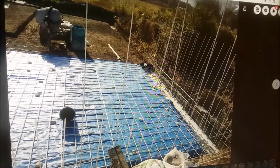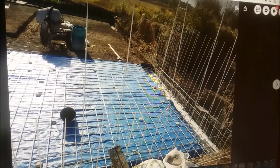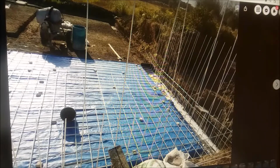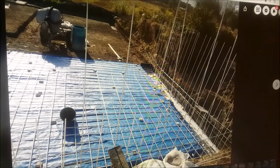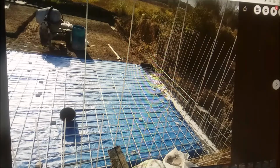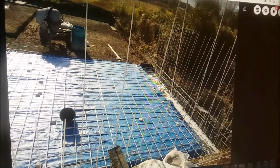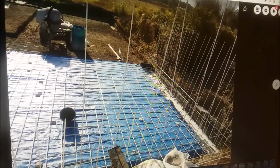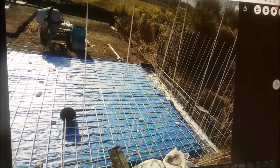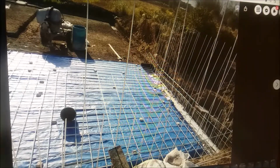They've got the dividing board here on the footer for separating the three pours. A little congested today. So this is 1/3. They're within an inch of each other, the three pours. What you see here is actually 1/3 of this total length back to here. Though it looks like the back's almost the same size as this, it's actually twice the width of this. It's just what the camera shows.